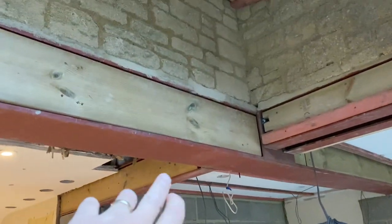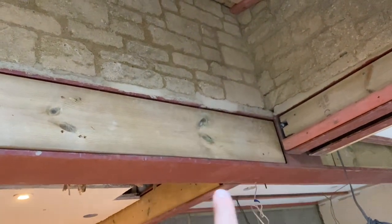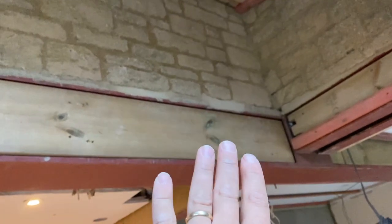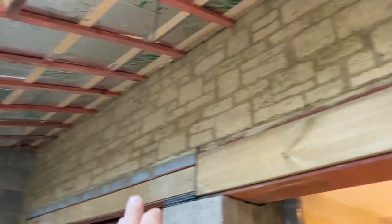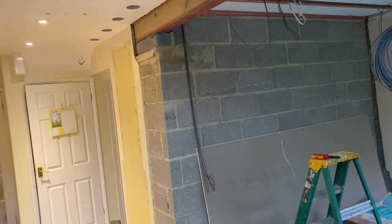I had a little chat with the client today. Because they're keeping this brickwork exposed — they're going to clean it off and repoint it — these beams have got to be clad with fireboard and plasterboard, which will leave an edge. They're then going to put timber on or whatever. I suggested we fit an LED strip all the way along this beam. Hopefully it'll be lit enough for me to mount the driver up here out of sight, and that will also be switched from over here.